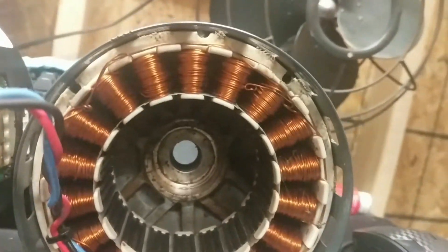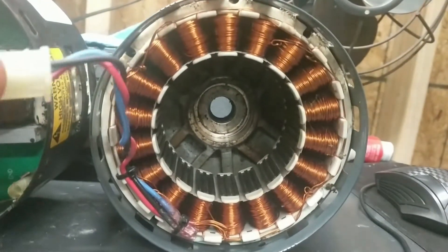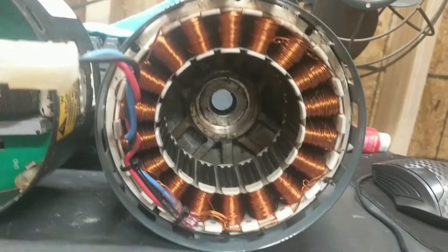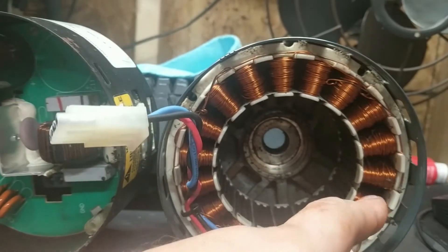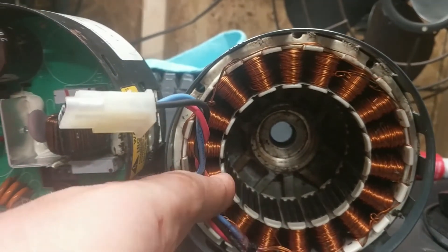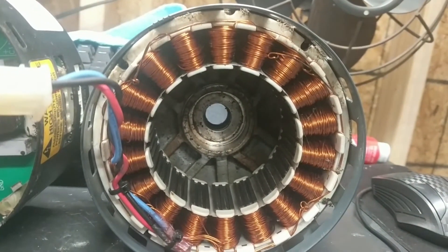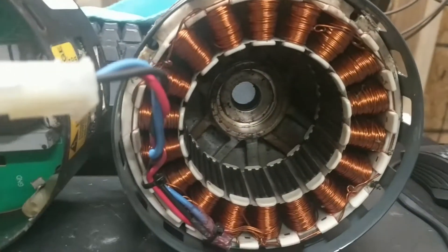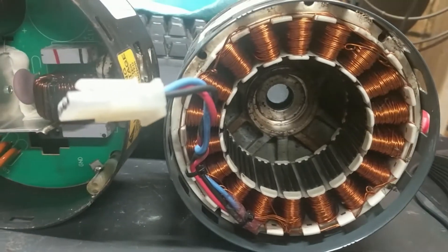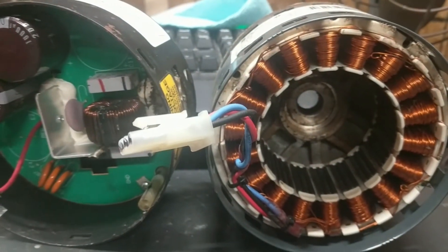There is no directional winding here — it's all just straight vertical coils. There are three wires and three phases that the ECM board creates. There are 18 coils total, so there are six coils per phase, and you've got three poles in the rotor. You're basically able to get your starting torque completely by magnetism, with the control board energizing individual windings to get at different positions of the rotor to get it to go. The way that it does it is very cool and saves some energy.